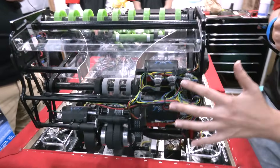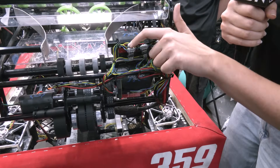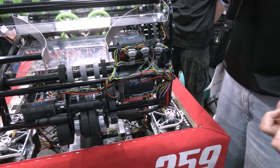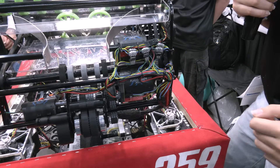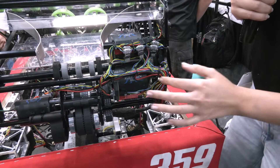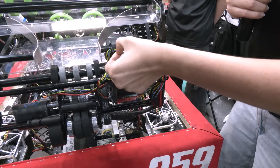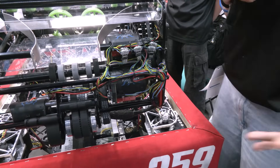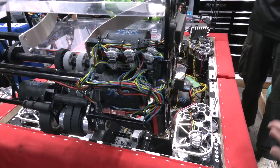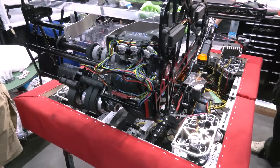Moving on to our CAN bus — here's a little example of it. There are two wires running: a purple and green line and a yellow and green line. These are both connected at the beginning at the PDH and at the end by the Rio. What this allows us to do is anchor into these two CAN lines, enabling a layer of redundancy with our wiring. So if one of these was cut, the other would be able to back it up.